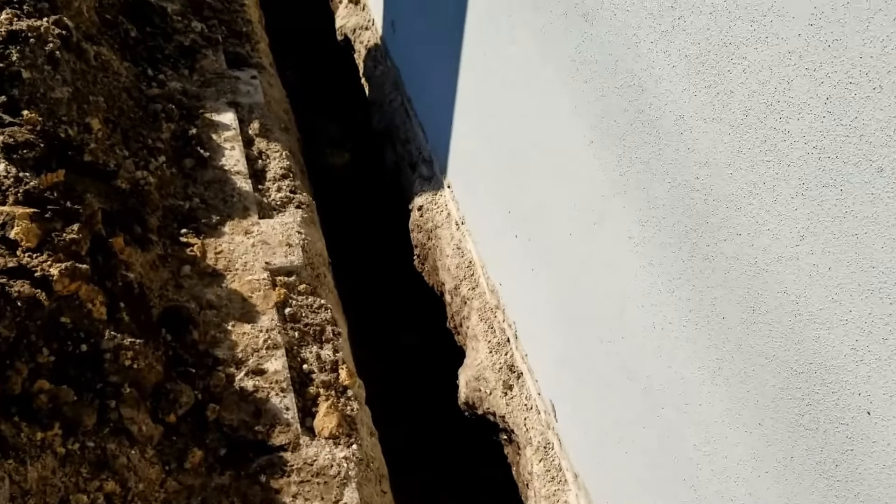Back here where Joe's at, he's just got a few more feet — he could probably scrape it out right now instead of digging. We'll take a little break. It's probably about 9:30, and it looks like we're almost done, but really this is not the hard part. The hard part is always putting it back together — sealing it, getting your pipe laid. That takes the longest. Once your trench is all dug, take some time and really clean this thing out. We're not too concerned about the cement on the footer — we want to get where that stucco is meeting that footer. We may come back with a wire brush, whatever it takes, we've got to get that clean so that our sealant can actually seal it up. We always get it really clean, then we'll put that liquid rubber on there and we should be set.